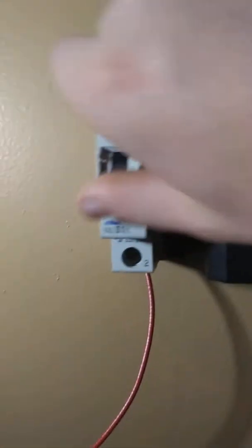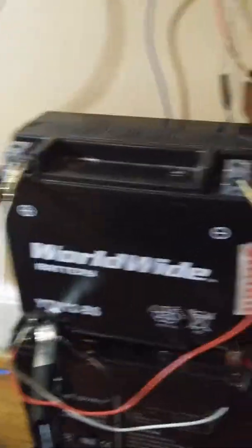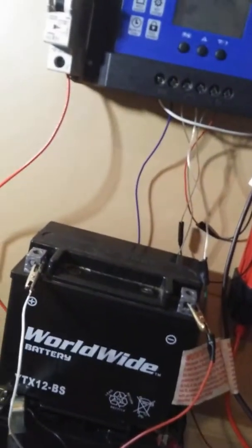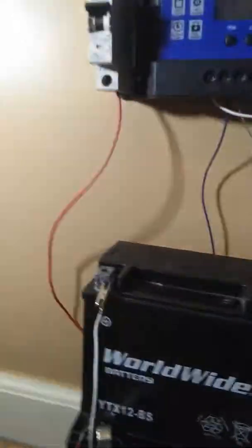It's still off and the voltage still hasn't dropped, and my inverter's still running. But it's better having this on because it brightens up my light and it'll charge my batteries. Since these are lead-acid batteries, I shouldn't really be drawing an amp from the batteries while they're getting charged. I should just put it up to the load side so it runs off the solar panel, and then they'll top off the batteries.